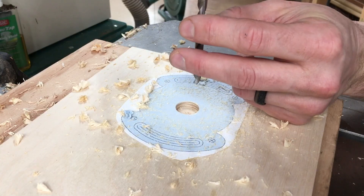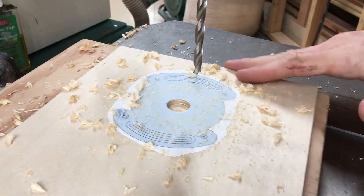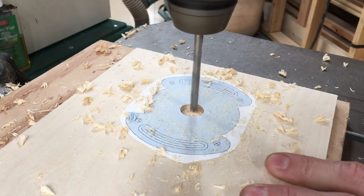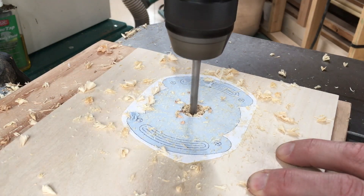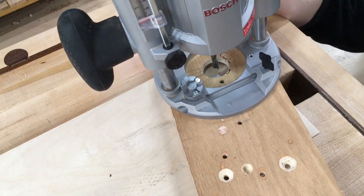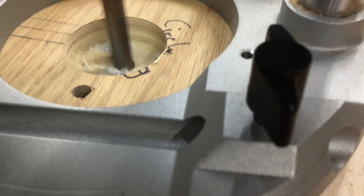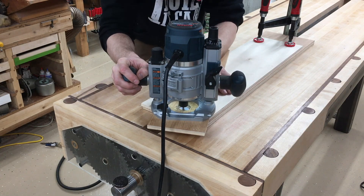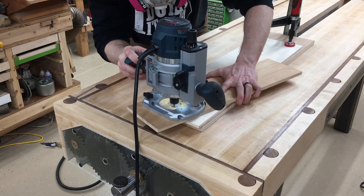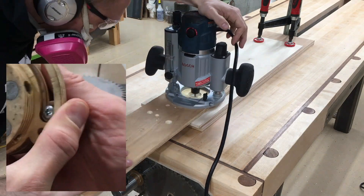Next we deal with the mount, which is probably the trickiest part. First, drill halfway through the material with a bit sized for the center rod - three-quarter inch for the small magnet, one inch for the big magnet - then drill all the way through with a quarter-inch bit. I use this bolt and nut to register with my router circle-cutting jig, or in this case a 60-degree arc cutting jig, to recess a slot for the screw head so it won't poke out, then make a second smaller slot all the way through so the screw can travel.